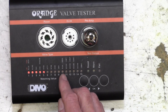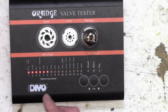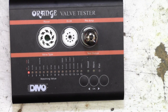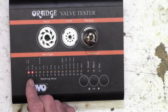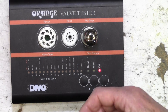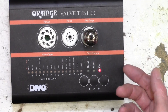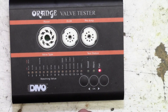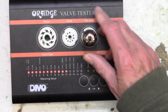For example it might say nine and ten — both nines is great because that'll be perfectly balanced. Nine and ten, eight and nine, seven and six — all okay. But if it was six and thirteen, that would be a hugely imbalanced preamp valve and I'd reject it. It's failed — now that is interesting. I've had a little bit of trouble with this orange valve tester where it will suddenly start failing preamp valves — put ten in a row and all come up fail, turn it off for an hour and they'll come up good. So I'm going to put that to one side and try again.